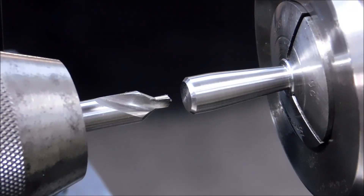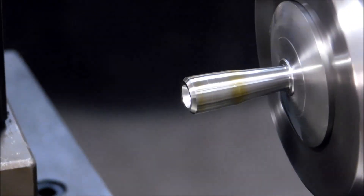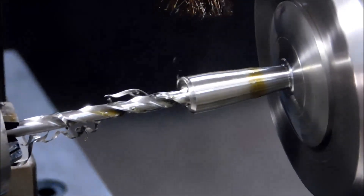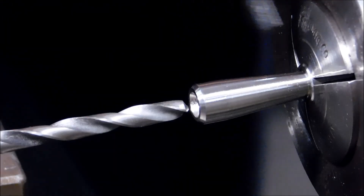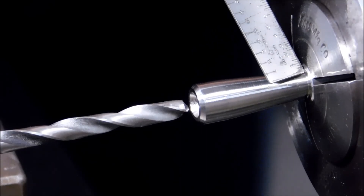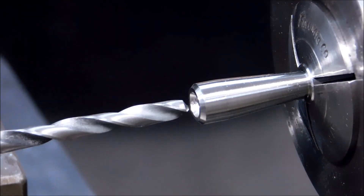Tap drill first. Once you pass your tap drill through your part beyond center, grab a drill the size of the screw you're going to use — a little bit bigger — so this is a clearance drill. I'm going to stay about 10 millimeters away from that undercut face. About 10 millimeters back on this piece, it's about 600 long.